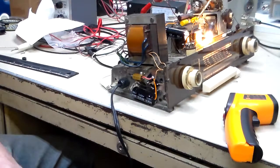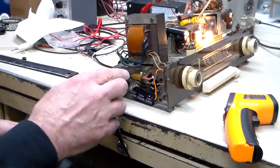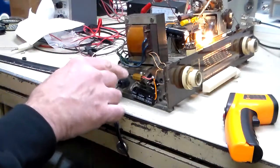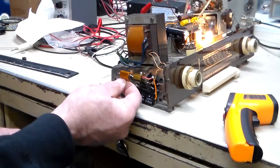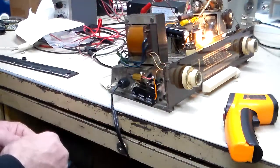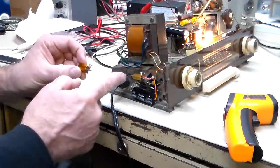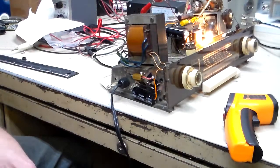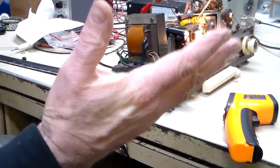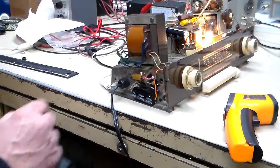So what did we learn? As far as heat dissipation goes, it's about the same. I wish the test would have been better, but after I pulled it away I'm not going to reattach the other one — these are solid wires from underneath and I don't want to break those. The Ohmite is about two-thirds the size. The resistance was pretty much within about 10% on both — this was 4.9 something and this was a little over 5. Definitely use it with a heat sink — I would recommend that. You'll get more durability and it'll last longer.